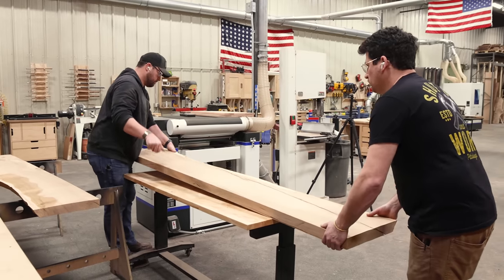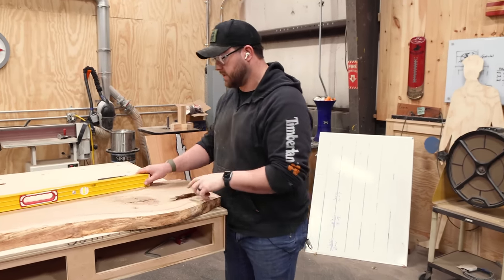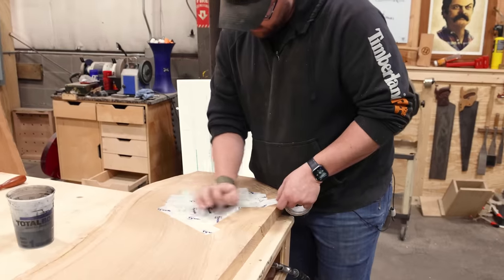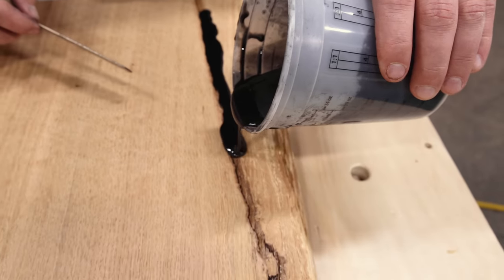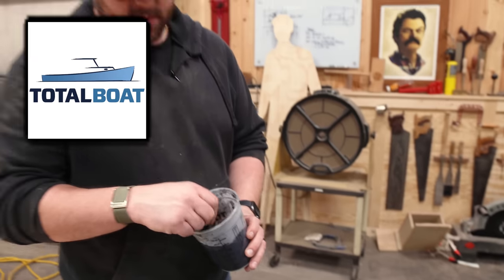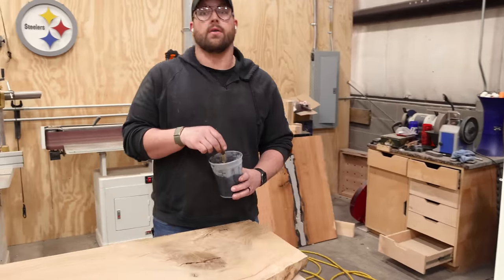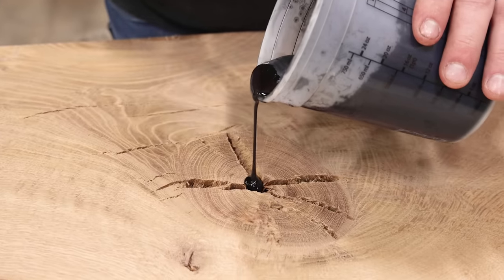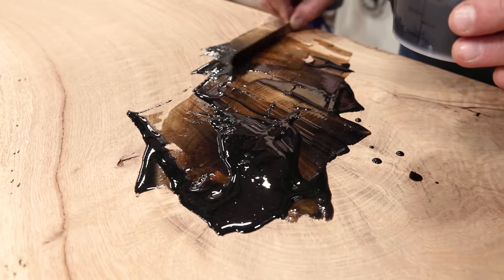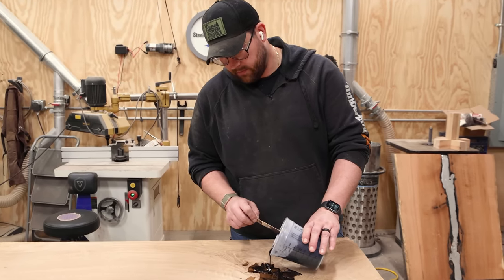It took a lot of the issue out. There was a little bit in the center, but by flipping it and taking very slim passes — about a sixteenth at a time — we got most of the excess thickness out. Now I'm going to clean up this crack, tape it off, and fill a bunch of these voids with resin so we can get it cured overnight. I'm using black high-performance epoxy mixed with activated charcoal instead of an epoxy pigment. Since we're staining the whole thing black, I want to make sure it's all the same black — so when I sand off the top, there won't be any pigment stuck in the wood before we do the stain.